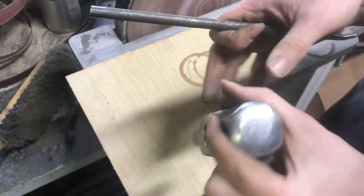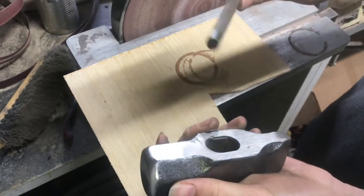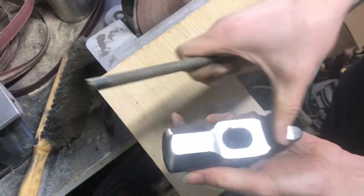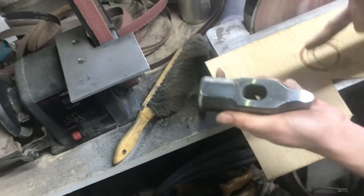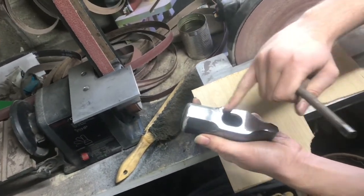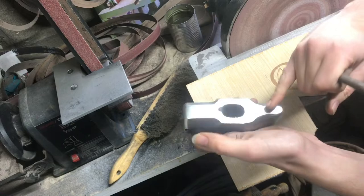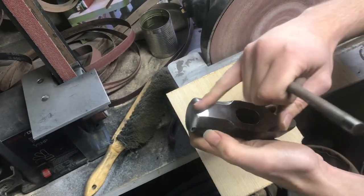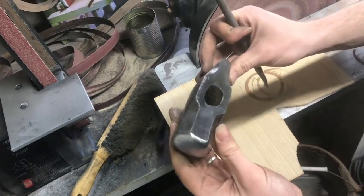The hammering surfaces are all taken to shape and pretty clear of pits. I'm deburring the inside and getting it nice and smooth, then taking it to the belt sander. The finish on top is a lot nicer. There are some residual machine marks — I'll go a little bit deeper, but I think the grinding marks do look better than the machine marks.